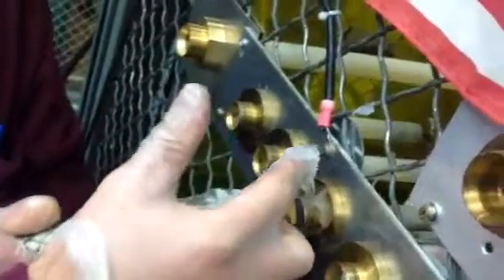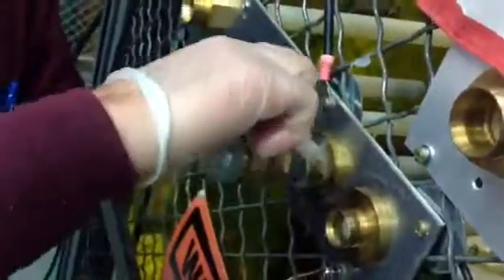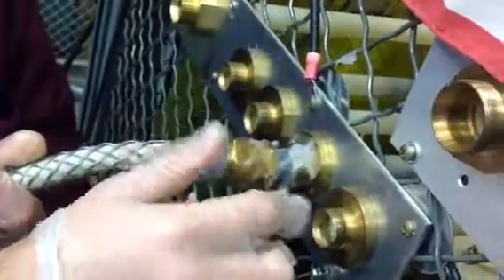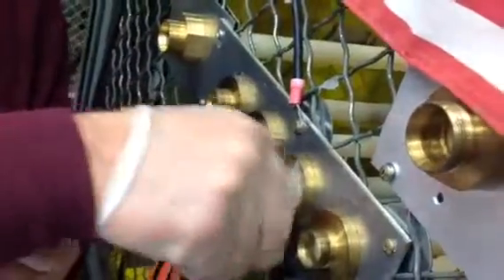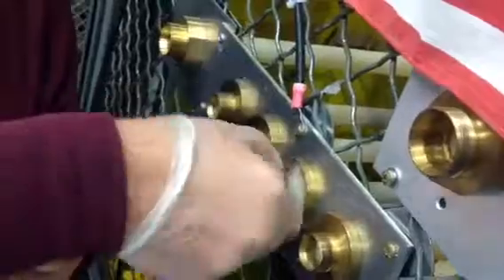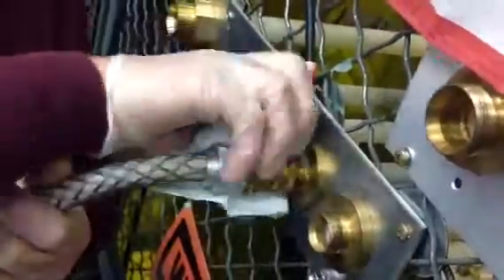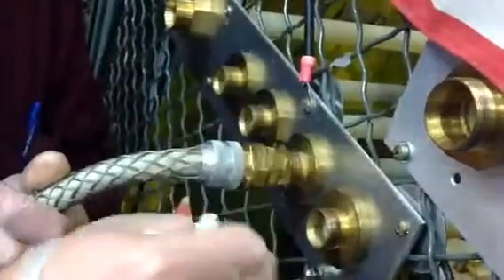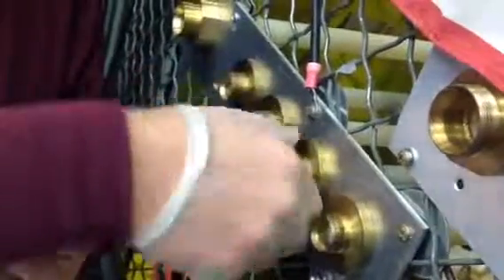You can see there's quite a bit of extra grease. I'm going to pull it back out just a little bit and reapply grease to the end seal here. We're going to insert it again — a lot of grease is going to come out, put a good amount on. I'm going to wipe it down, and then tighten the connector all the way. I'll hand tighten it, but you can tighten it as much as you need to.